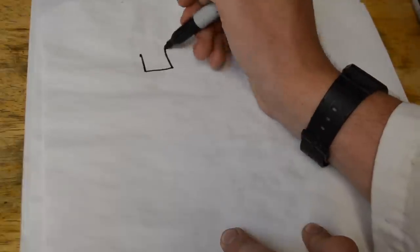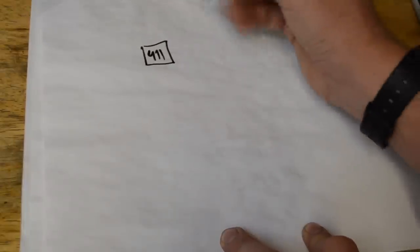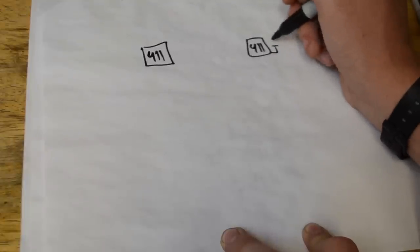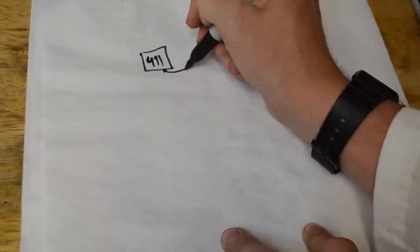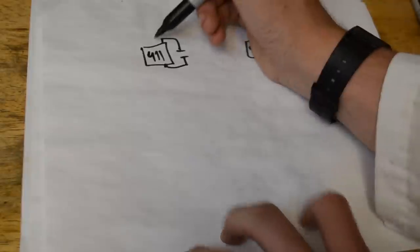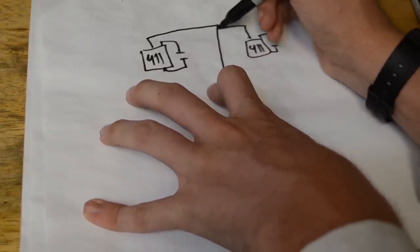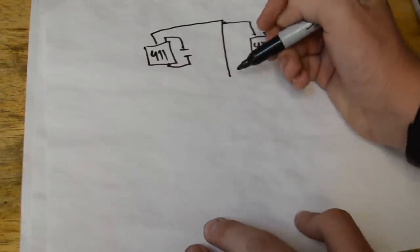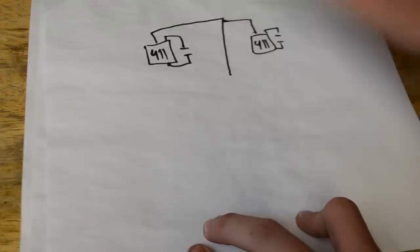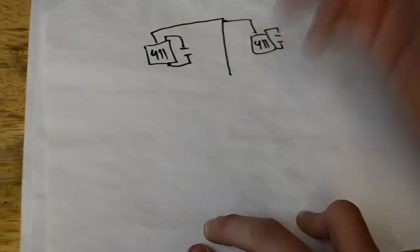Let's draw this as a block diagram. We have the 411 kilohertz oscillator here and another 411 kilohertz oscillator — we'll say that's just the capacitor for each part. In our specific theremin circuit, the inductance won't be changing but the capacitance will be. These two frequencies are being meshed together, and the difference between them is going to be outputted, since at 411 kilohertz it's definitely out of the audible range, so we need to get it down somehow.